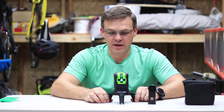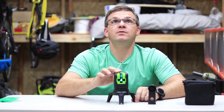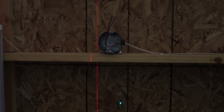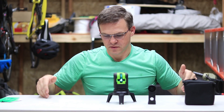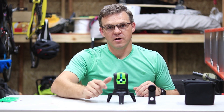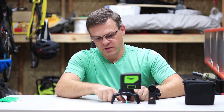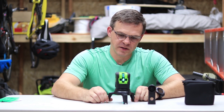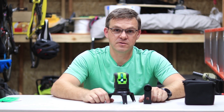After using it for about three months, I like it, but it's not as strong as the Makita laser. This is a green line and the line goes pretty well, but the dot obviously projects all the way up while the line doesn't reach as far as the Makita. The reason I wanted the dot is because you can measure off different walls — set it on the spot you want and it'll show the dot on the ceiling. It says it's waterproof and can tilt up to four degrees before it can no longer auto-level.